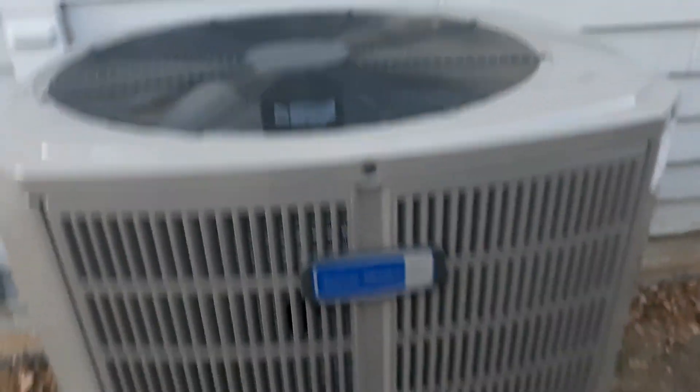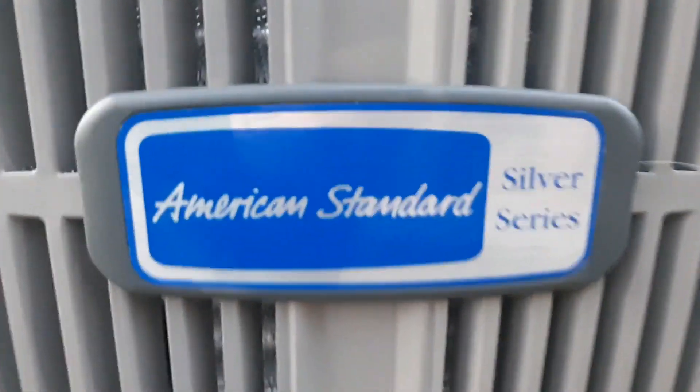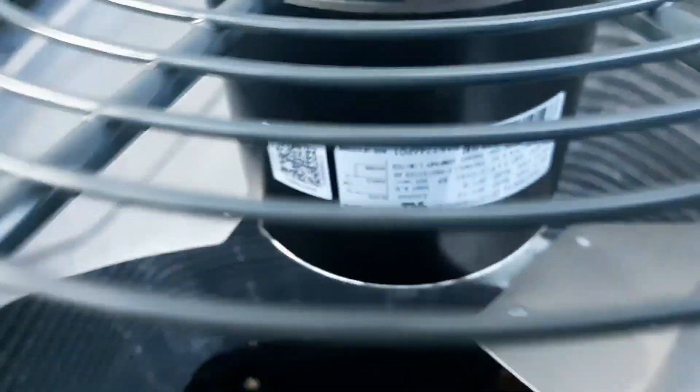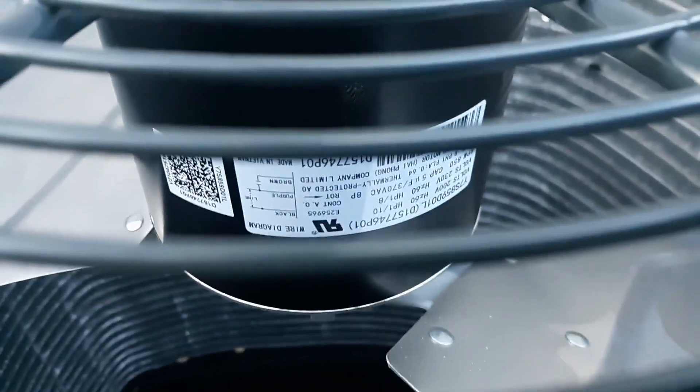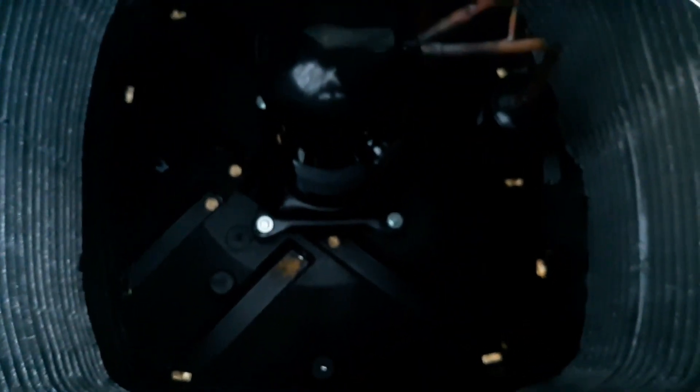November 28th, 2022. Here's the new unit, here's the first look at it — new American Standard Silver Series. It's got spine fin coils. There's the fan motor; it doesn't say what brand it is, I don't know what kind the fan motor is. There's the compressor — it is an Alliance scroll. Thankfully it's not an LG, it's got an Alliance.